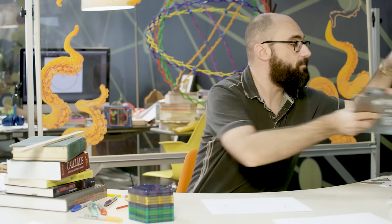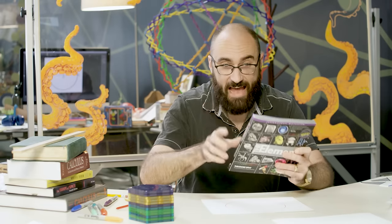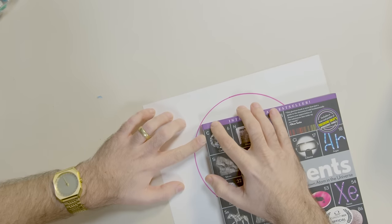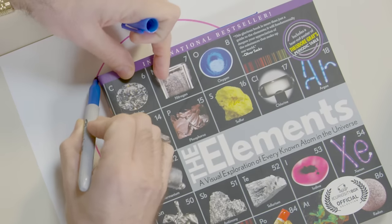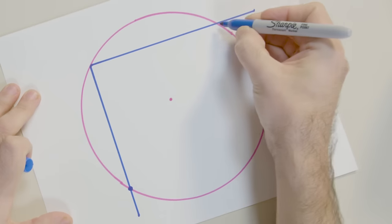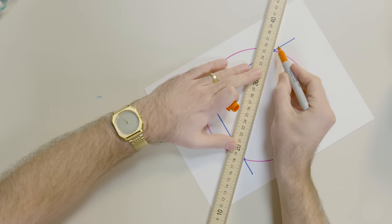I'm not really happy with that, but let's see how far off I was. How do we find the center? Well, one way is to use Thales' theorem. All you need is a right angle. For that, I'm going to use something else that comes in the best of box — the Elements book. Every single element displayed and celebrated the way it should be. This book is fantastic because it has a nice sharp right angle. To implement Thales' theorem, all we need to do is put our book inside the circle and line up the vertex of its right angle right on the circumference of the circle. Now, we take that vertex and extend two rays along the edge of the book. Thales' theorem tells us that the two other points where these rays contact the circumference are diametrically opposed — they are on opposite sides of the circle and a line passing through them will pass through the center. Let's draw that line in orange.